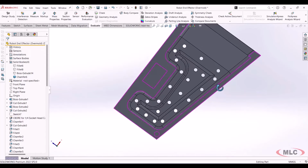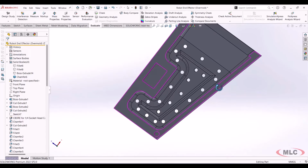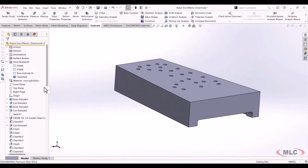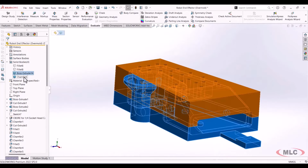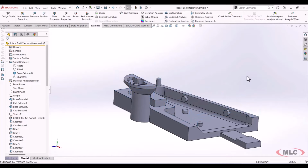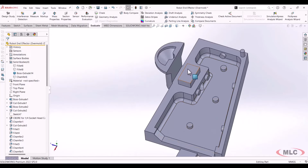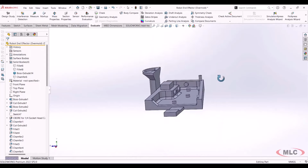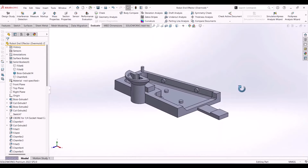And you can see I really got overzealous with this, particularly because we don't have a vacuum chamber to degas the resin before pouring. Now finally, the last feature I want to showcase, and it's easy to see here, is I have two locating features that allow this to mate together and not swivel or pivot in any way, shape, or form. So that's what we're dealing with on the overmold.